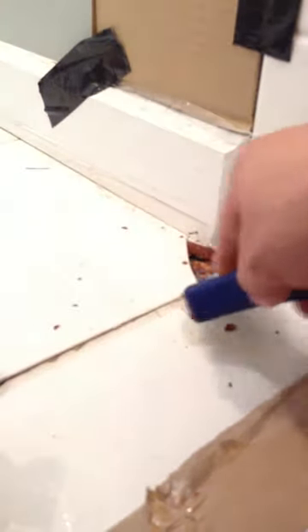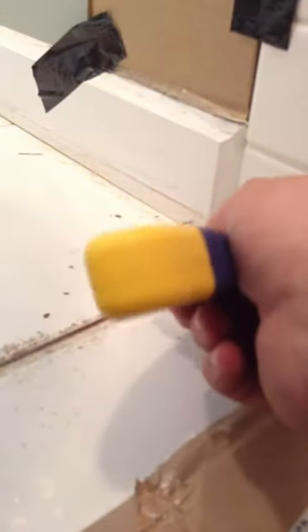Now this here is designed to get the grout out. It doesn't always work — it's basically just to get like the top layer out, not all of it. Then you can re-grout. But I'm going to try to just get a little bit of this angle here out so I can get my little pry bar on anything. If you make long strokes like that, it works pretty well. Sometimes I start it by just going back and forth in one area to get kind of a little groove.